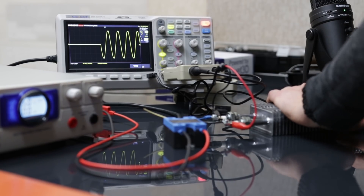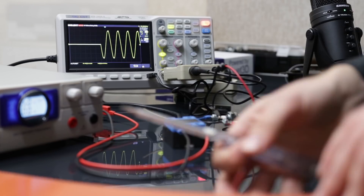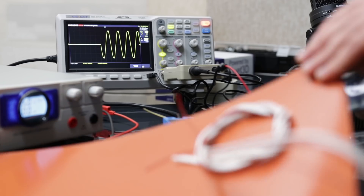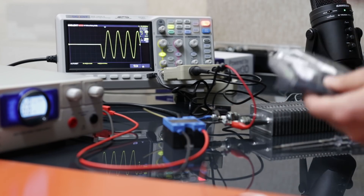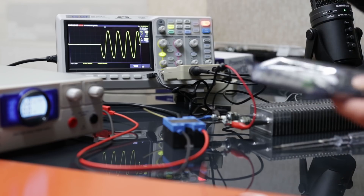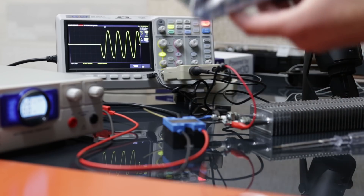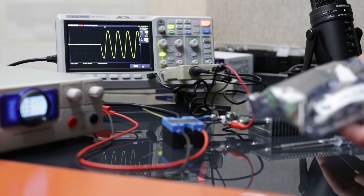I have some cold hands, so this heater is nice. I have two of these - one for this heater and one for this heater mat. I'm going to use the 12 volt bed output to control one, and the 12 volt extruder 2 output to control the other. I'm going to modify the firmware to do that and see if I can use this board to control this heater, which would be pretty cool.